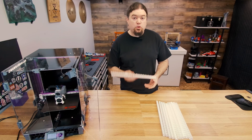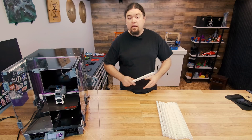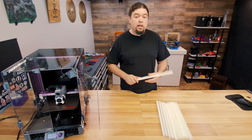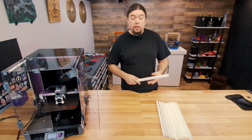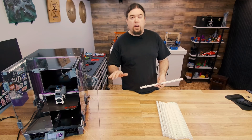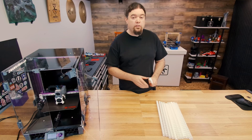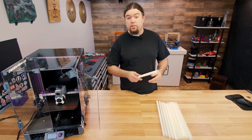All my light parts are ready to go. I did these on the FT6 and the Tank — the Tank is 350x350 and does one at a time. On the FT6, I did four of these all at once; it takes around 27 hours since I print pretty slow on that machine. I also used white filament — this is all PLA. It should be just fine for these lights, and the white color should deflect the light a little better. Now I'm going to go over to the shelf, uninstall all the lights I have right now, and feed them into all of these parts.